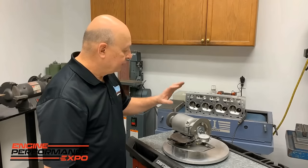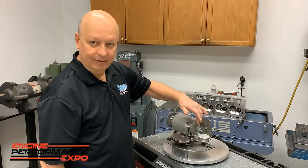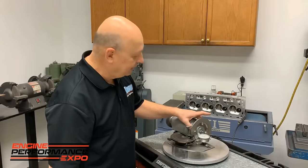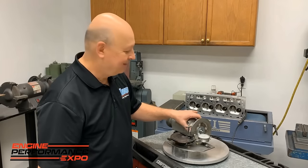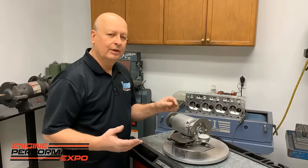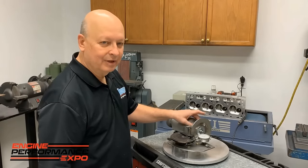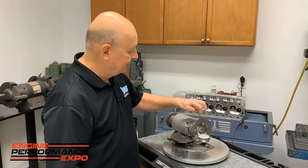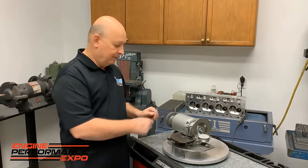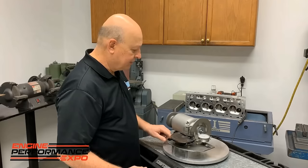And so we have the diamond wheel here. It's got years' worth of room on it. It's 220 grit. We have to do a little bit of lathe work to make an adapter to put it on, because it's got a half inch shaft, and these other wheels have a 1 inch hole in them, and it needs a little bit of backing. But when you get all done, get that thing indicated in so it runs real good. We have a little Scotch-Brite wheel on this end, and we do grooved rings on it after we grind them. But this thing, it's just awesome.